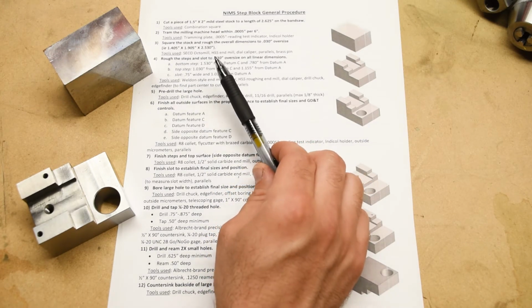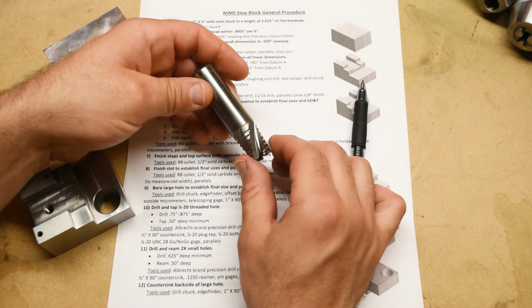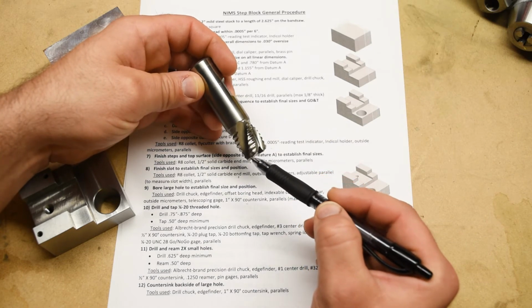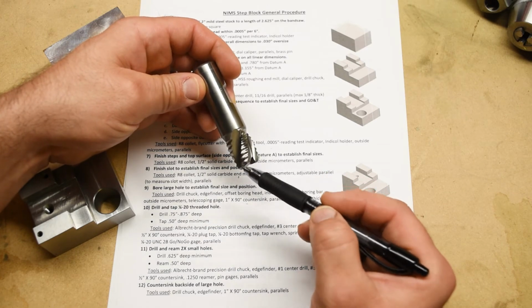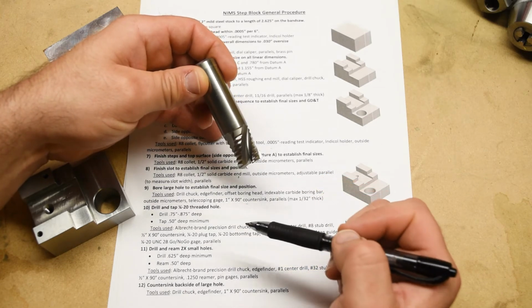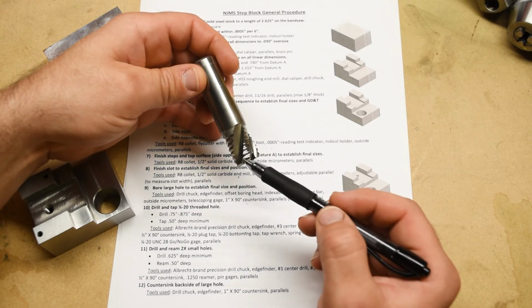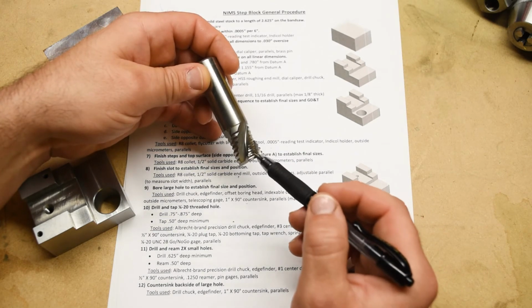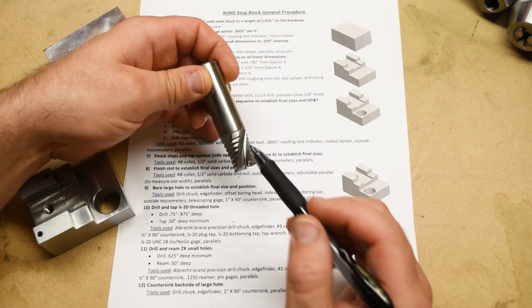And that's going to be fun, because we're introducing a brand new cutting tool to your repertoire, the roughing end mill. The roughing end mill has these sort of serrations on the cutting edges. It's like it's wavy or scalloped on the cutting edges, like a bread knife or something. This is why this style of cutter is sometimes affectionately referred to as a corncob cutter. This type of tool is designed to take big, heavy, hogging cuts out of material. These things are freaking amazing. You are going to have a lot of fun,